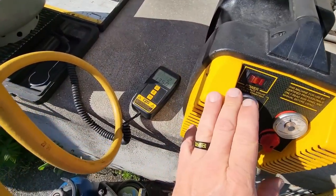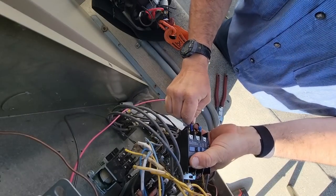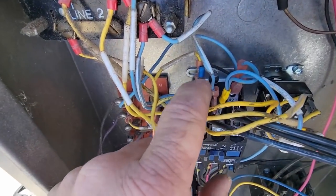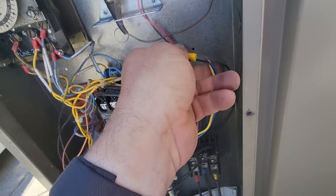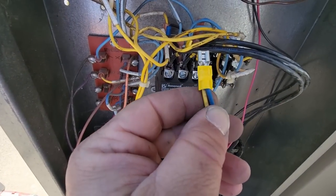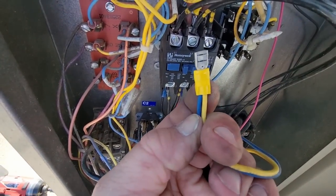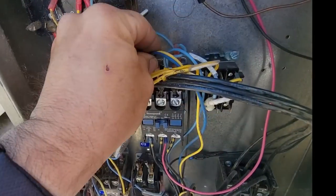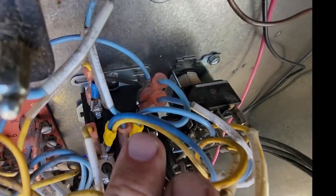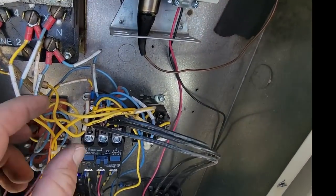While we're waiting on this, we'll go ahead and get this contactor changed out real quick. Power is off. They've got a really nice crimp and a relief crimp. These connectors — we've got too many of them in there, they're not fitting for squats. So I stripped it, kind of go ahead and get that all underneath one. It makes a good crimp — you can see it completely flattens it across the front to back, pinches the outside edge corner. Makes it fit a lot easier and now you can get right on to the terminal. Not a big fan of running it through that without a Romex connector, but it is inside the box, so theoretically it's probably fine.